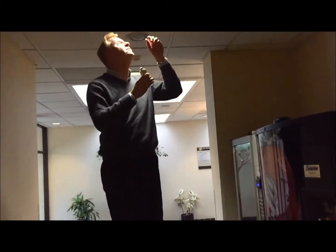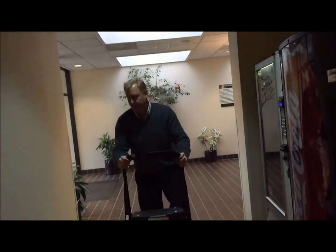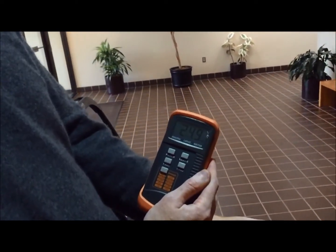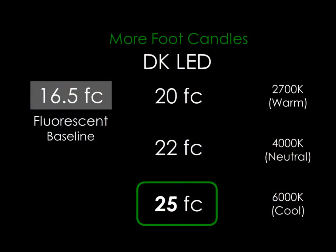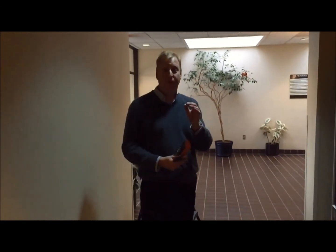I have the 6000 Kelvin G24 direct replacement as opposed to the 4000K. We're expecting that this is going to have a higher output in terms of foot candles than both the 2700 Kelvin range and the 4000K. This one comes in at 25 foot candles. The incremental increase is part of the output differential, and it's really a question of output level and light color that customers want to see in their ceilings.